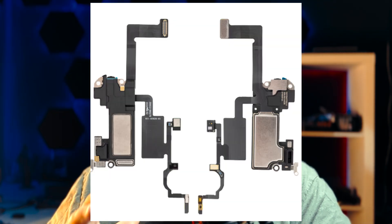Apart from that, there's only a handful of other repairs you can really do properly by eye — for example, an ear speaker on an iPhone. They're really simple to replace. The ones attached to the proximity sensor are super simple to replace and can be done by eye with just a soldering iron.